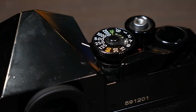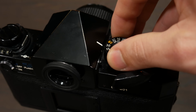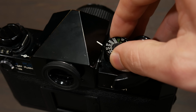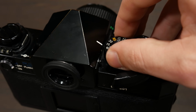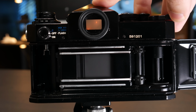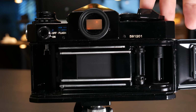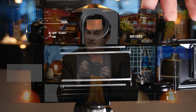Everything is where it is because that's where it needed to be. All the controls are physically connected to the mechanisms they activate, which makes them delightfully chunky. You can see how turning the film advance lever cocks the shutter by moving the two halves of the shutter curtain in unison. And you can even hear the little clockwork mechanism that controls the shutter's timing at long exposures. Take a listen.